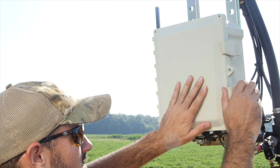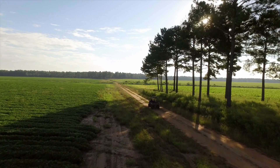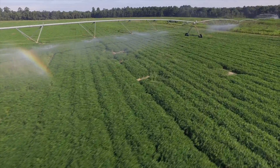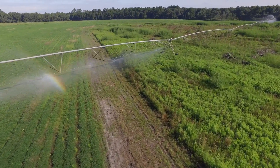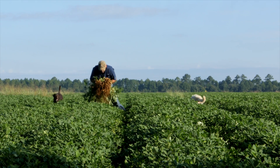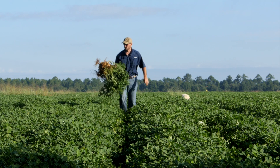We can also adjust water rates across the field where the soil holds more water. VRI can enhance water conservation in a couple of ways. First, we can use it as simply as an on/off system — if we're traveling across the field and we have non-cropped areas, we can just turn those nozzles off, which conserves water right off the bat. Secondly, by site-specific placement of water, we don't want to put quite as much water on a clay soil as we do on a sandy soil — we match up the requirements and reallocate that water to better use that resource.